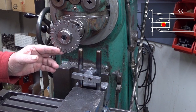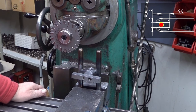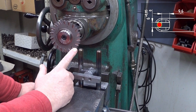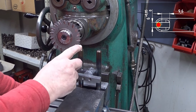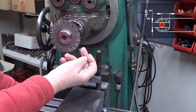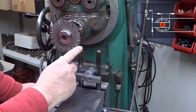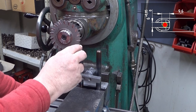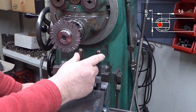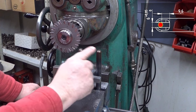If I move it exactly 8 millimeters, then this side of the plate will be in the center line of this. And since this is a 3 millimeter wide slitting saw, it will create a groove which is suitably sized from the middle point from that direction, 3 millimeters. Then I just need to move it 3 millimeters this way, and after that mill again. So then I will get a groove which is 18 millimeters deep and 6 millimeters wide in the middle of these. And since these are like this, the other groove here will become automatically aligned.